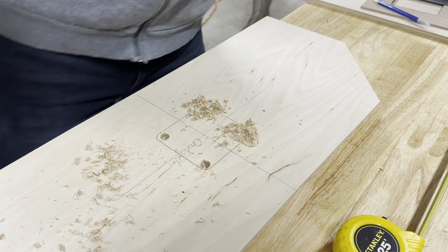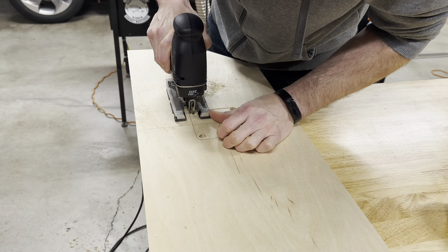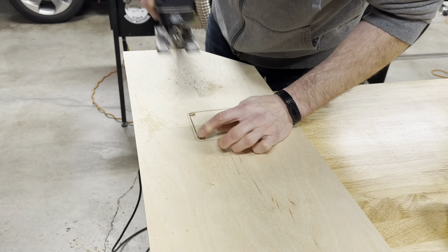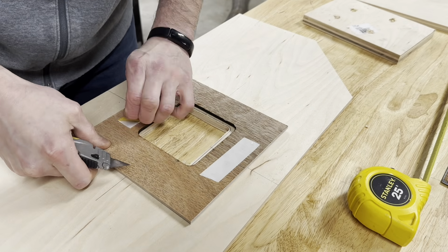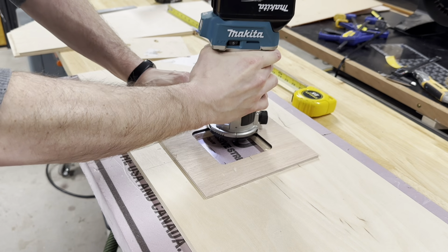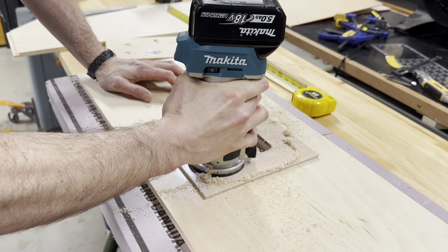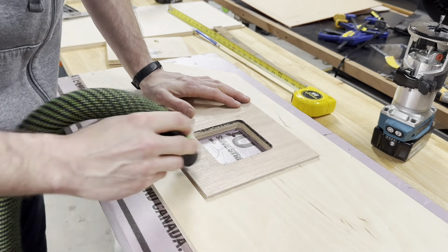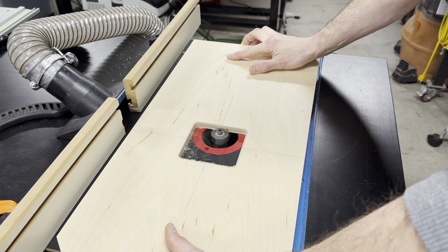So I got this idea from my days as an aircraft mechanic. Some of the jets I worked on had engine compartments or auxiliary power unit compartments that would have these little fire access panels. So the idea was, if there was a ground fire on, say, an auxiliary power unit that was accessible, you could jam the end of the fire extinguisher nozzle into it and discharge all the halon inside, flooding the compartment without letting it go all out into the atmosphere and not extinguish the fire.